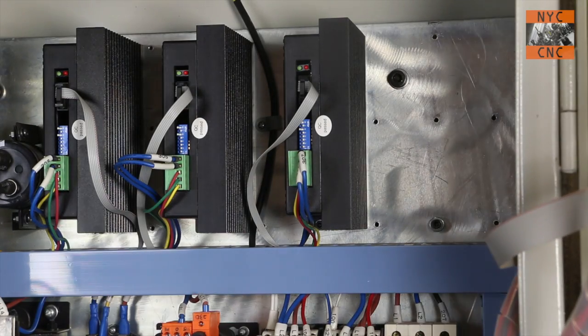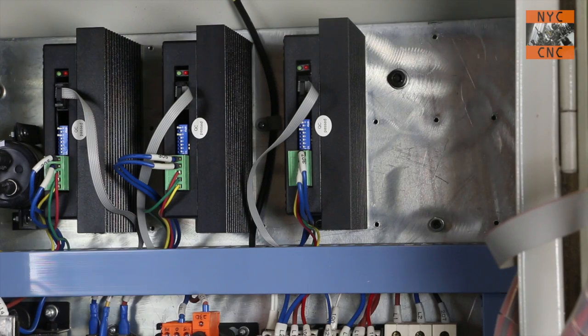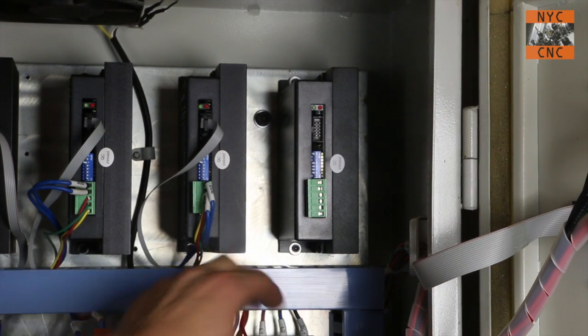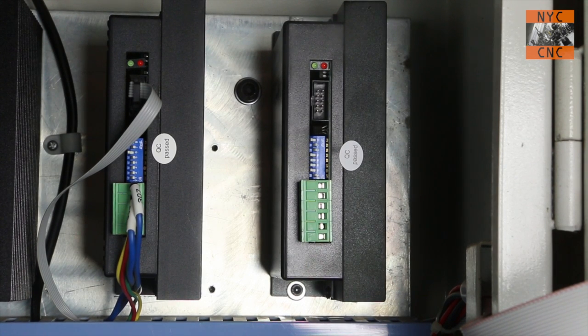To install the actual driver box, you need an M4 screw in the bottom. The book says it came with two — I don't know where mine went, I probably lost them. I put an M4 by 12 in there. Back it out a little bit, set the driver on the bottom screw, snug it down and put in the top screw. For the NEMA 34 fourth axis, which is what we're dealing with on the 8 inch, set your jumpers to: on, off, off, off, off, on, on, off. So jumpers 1, 6, and 7 are on — that's 3 total that are on — and the others: 2, 3, 4, 5, 8 are off.